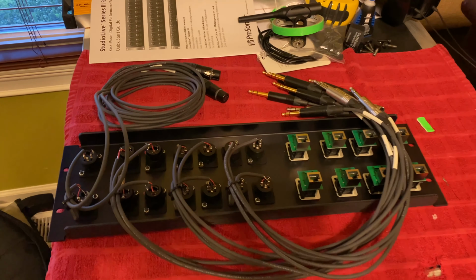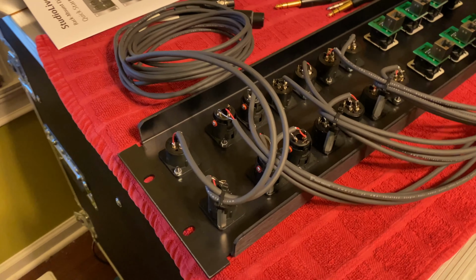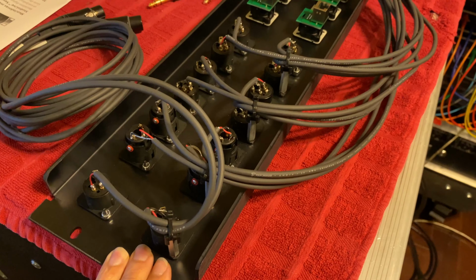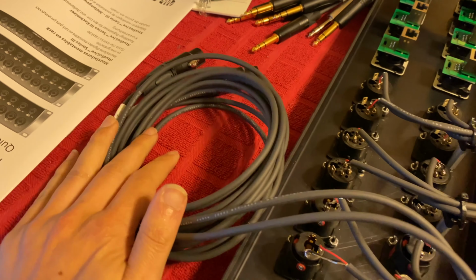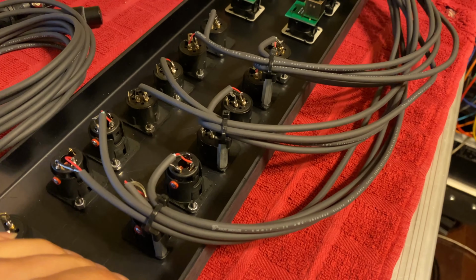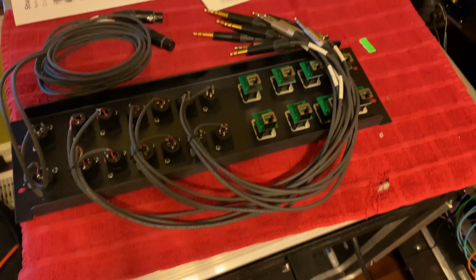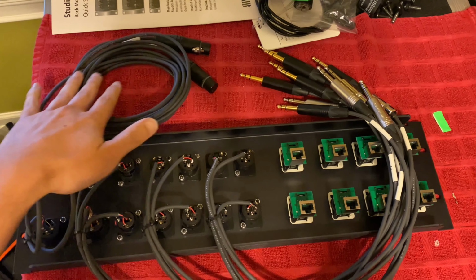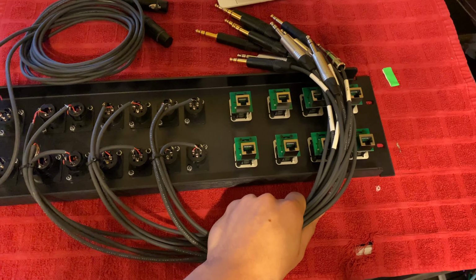Everybody, we are finished up. So here is some detailed looks at the back. We do have tethers going on each one of these, which we installed earlier. Here's our matrix outputs, 7 and 8. Here are all of the quarter inches terminated. So the tails on this aren't very long. These are long enough to patch directly to the console, and then these are actually only long enough to go to the patch bay that is right above it.